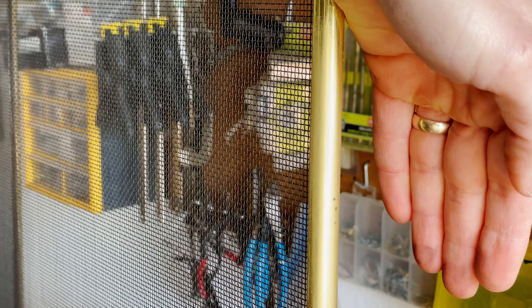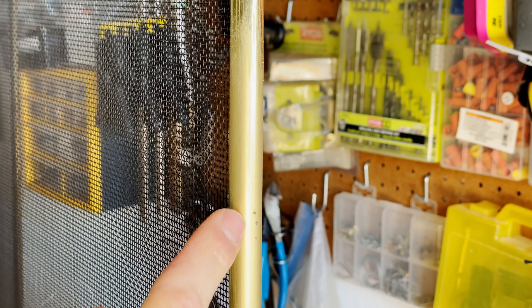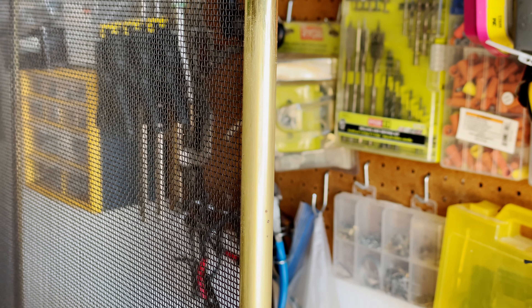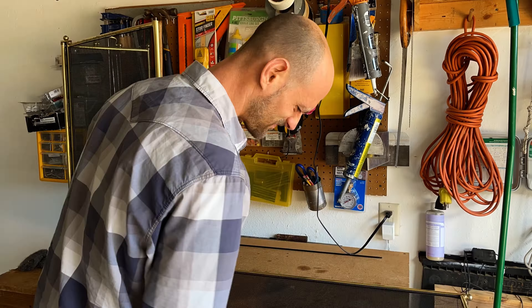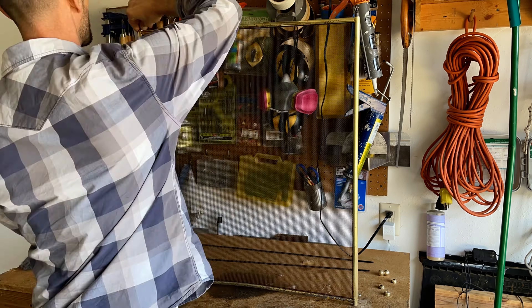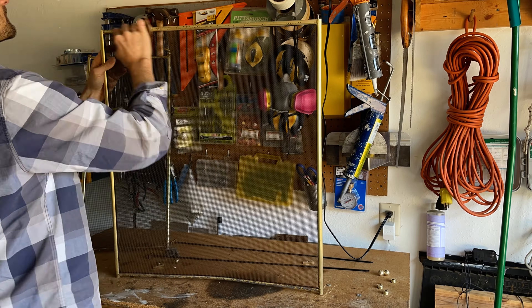You can see there's no real shine left on it. You can see some of the scratches, but it should be looking kind of foggy like this instead of shiny. You'll continue to use your steel wool, Brillo pad, or 120 grit sandpaper to lightly scuff the surface to be painted. I didn't worry about scuffing up the screen portion since it was going to be the same color I was painting it.